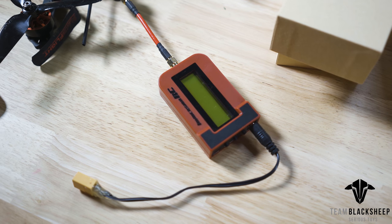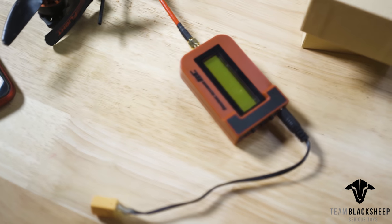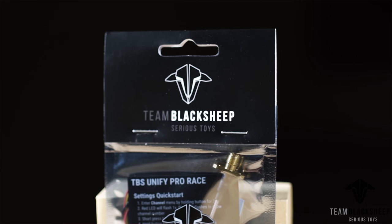I created a little test rig here. As you can see, I am using the immersion meter. There's a TBS VTX in my quad here that I'm going to use as the baseline. TBS is the gold standard VTX — it's the one accepted at every single race I've ever been to in the U.S. Immersion's also very good from what I understand. What's important when you're using a VTX is everyone has the same power levels. I'm going to test the TBS one and show you what it outputs when it's in 200 milliwatt mode, then we'll show you what these random VTXs output.